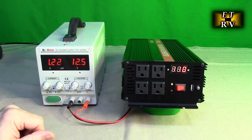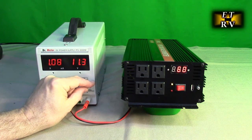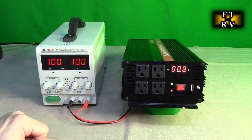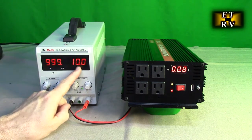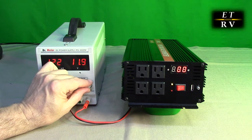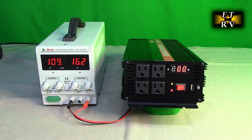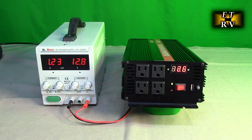Let's look at the alarms. If your input voltage from your battery pack goes below a certain number, I'll lower it — and you can see it noticed it, giving me a fault number and turning the unit off to protect it, because low voltage causes the current to spike up to compensate. Now if we increase the voltage and simulate batteries going too high, another alarm kicks in because the battery voltage is too high and the unit shuts down. Those are the two voltage safety protections on this inverter.